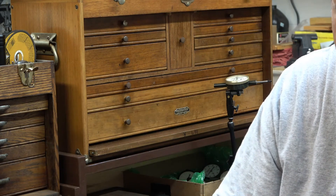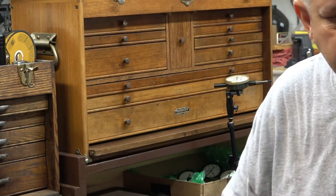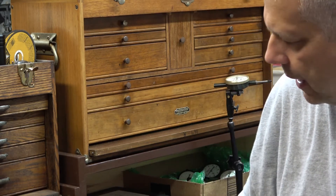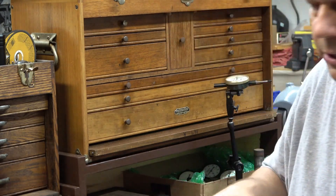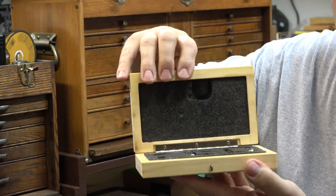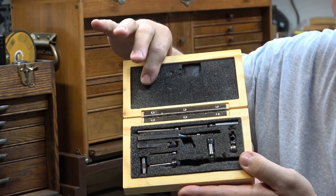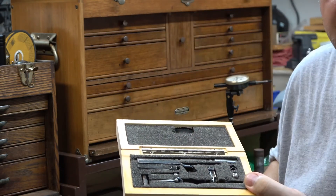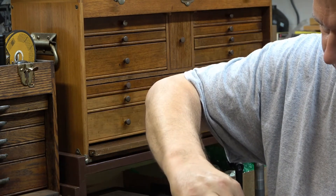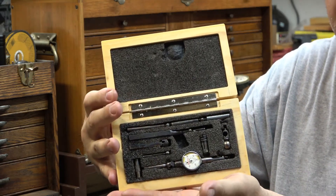Now if you remember, when I was talking about this, the box was busted. There are probably a lot of people out there who could have 3D printed me one of these boxes, but I went the old-fashioned way and decided to make a box for it. The styrofoam inlays that were in here I took them out, and I cut a couple pieces of wood and kind of made it like the old Brown and Sharpe style test boxes. I machined it out on the mill machine to fit the styrofoam inlays. So this kit was 100% complete — the only thing that was wrong was the dial indicator itself. We'll put this right back in here where it belongs, and that kit is complete.